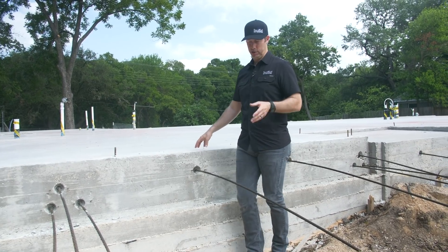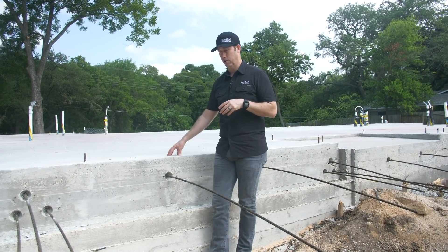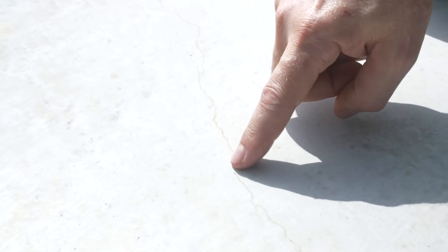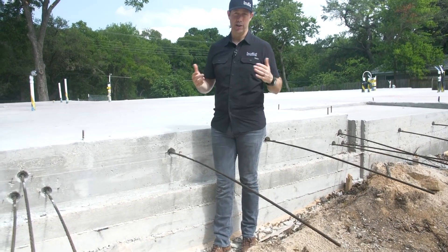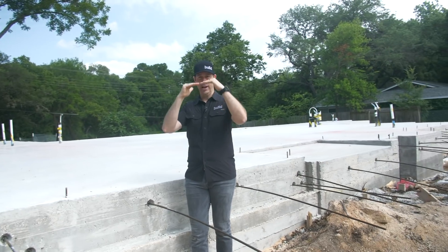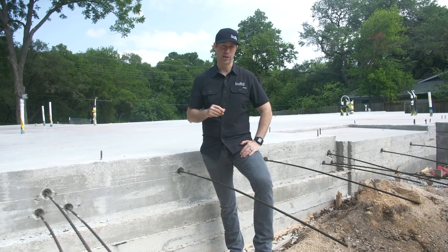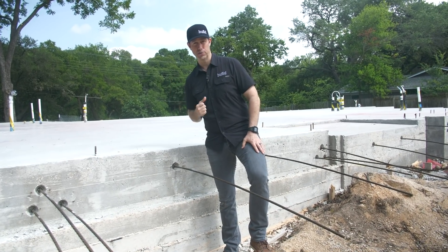The benefit most talked about by builders is that you're going to see a lot less cracking on a slab like this than on a standard rebar slab. In general, most of the time when you see cracks on concrete, you're seeing spider cracks or smaller cracks. If those cracks are in line with the other side, they're really not structural — they're usually shrinkage cracks, nothing to worry about. You need to start worrying when you see the concrete moving dimensionally up and down differentially on one side of the crack or the other. Most concrete cracks you see are non-structural — they're just cosmetic. The old builder's joke is there's two types of concrete: concrete that's cracked and concrete that's gonna crack.